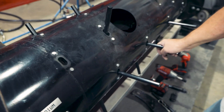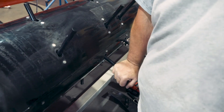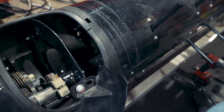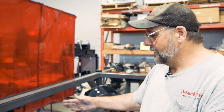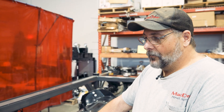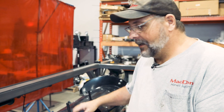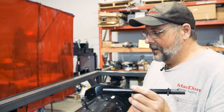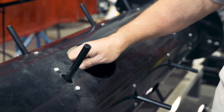When it comes to installing a finger inside your auger, there are additional finger holders that are unused — they're already there. The auger can support a maximum of 30 fingers, and there are enough holders to install a finger in every location. If you have the medium configuration and want to switch to wide, you'll need to buy some additional fingers, but you can buy the finger and the guide as a kit. Look it up in your parts manual and you'll find a guide, a finger, and the hardware.